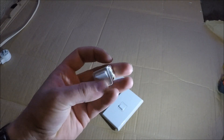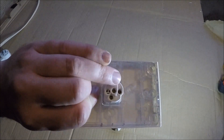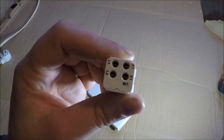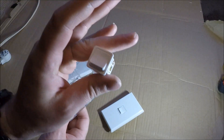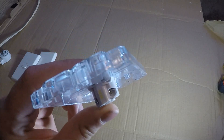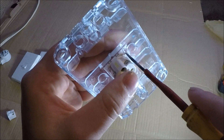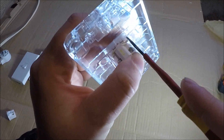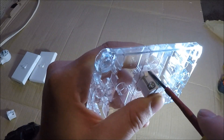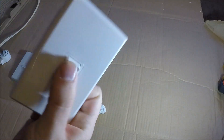To make three-way switching work you're going to need an intermediate mech. These mechs are sold separately — they don't come on the light switches. Intermediate mechs have numbers one to four on the back. One of the switches you'll need to pop the mech off the back and throw this one in. An easy way to pop the mech off is to get a small screwdriver, push it into these small white tabs, apply a little pressure on that corner, then do the same with the two clips on the back and the mech will pop out. Throw your intermediate mech in — it needs to be the middle switch in a three-way switch combo.